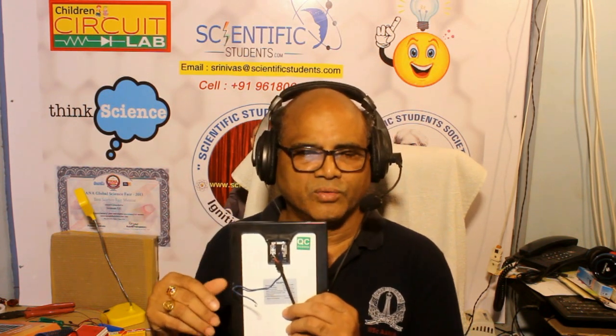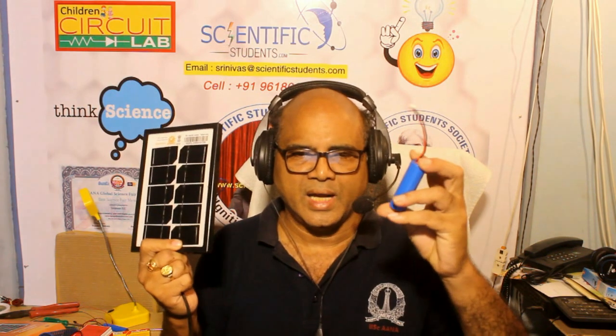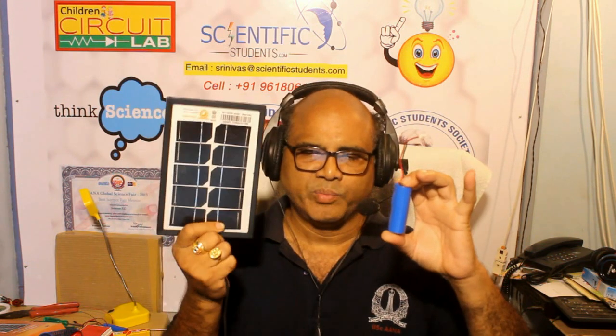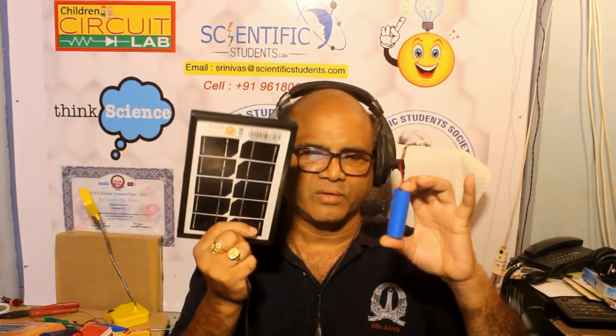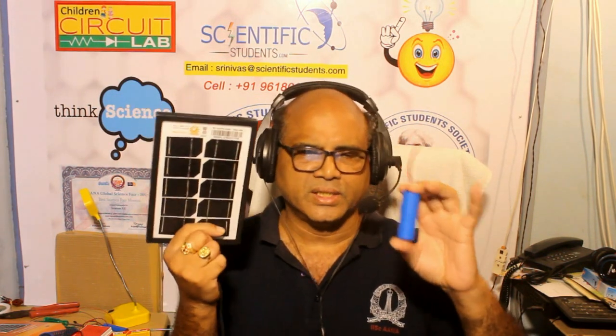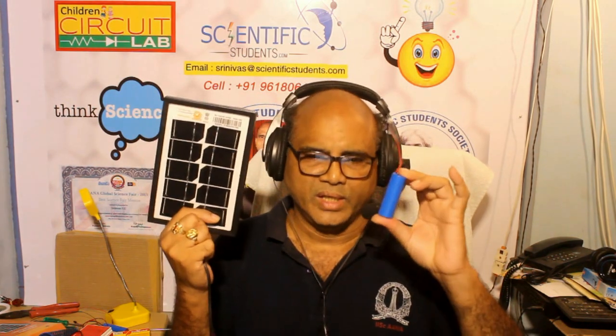Power is the product of voltage and current. So 5 volts multiplied by 0.5 ampere maximum current gives 2.5 watts. Near about 6 watt-hours of energy can be stored into this lamp. You get 2.5 watts from this panel in optimum conditions. Three hours is sufficient but take roughly 4 hours so it can charge the battery comfortably.